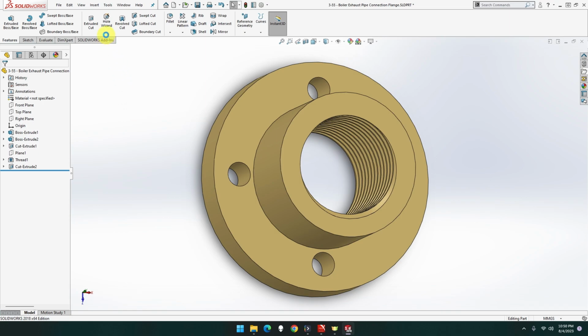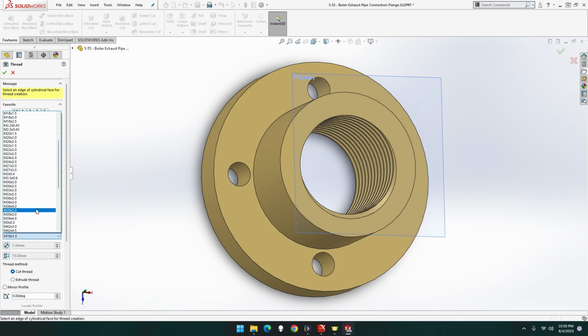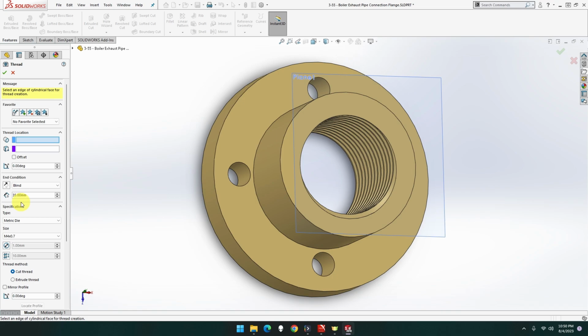Now that's got to be a 4mm hole, thread. So now we've got to do thread. So let's turn on this plane again. We can use that in these holes. Yeah, why put another plane in? We can use that one, right? Thread. Where are we? Down a bit further. We want 4. That's 42. Where's 4 gone? 48. 4 by 0.7. Okay, that's all we got.